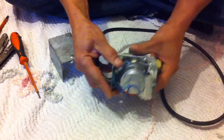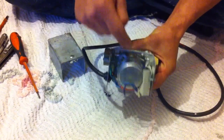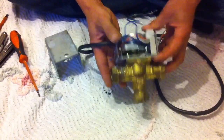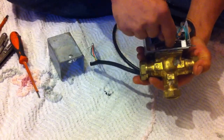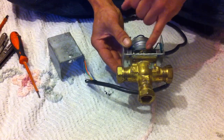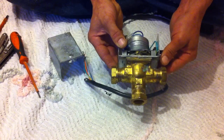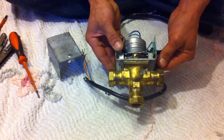Off it comes. Internally, you have a synchron motor. This is basically a motor which operates the gearbox below. It's 240 volts AC. What that does is literally rotate this spindle here — it rotates a large thin cog and rotates the spindle that drops down into the water section. You can actually see that move as it's operating.